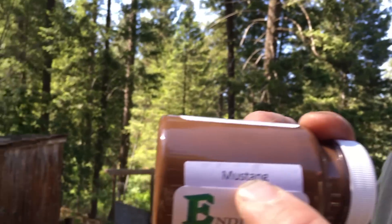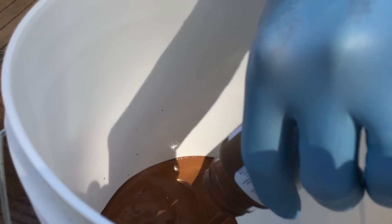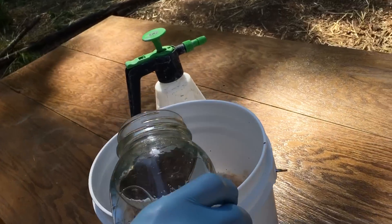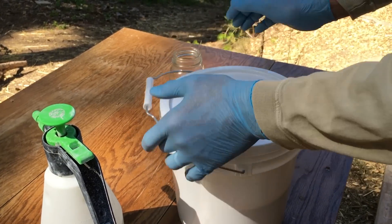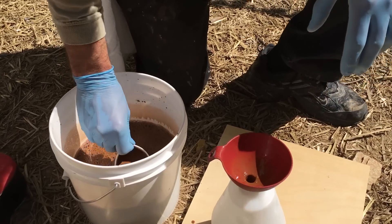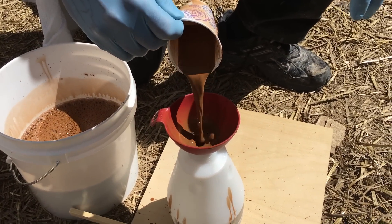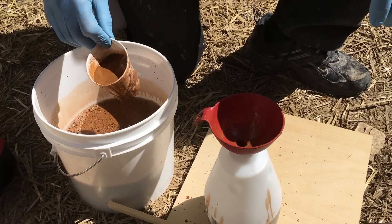What's the color? Mustang. The stain is a water-based stain — it's a whole lot of pigment just in water, so there's no binder to it at all. It goes down pretty easy in the sprayer. We chose to do two different colors: a lighter brown to start with, and then phasing in a darker brown until it looked the way we wanted it to.